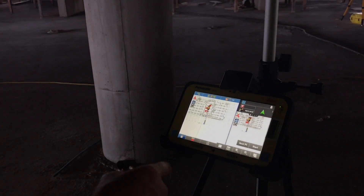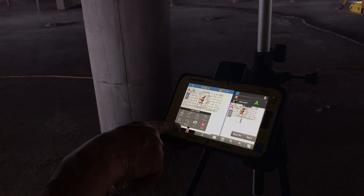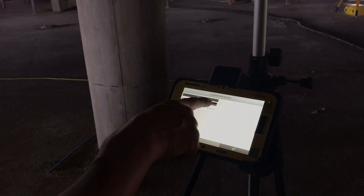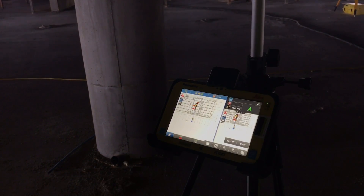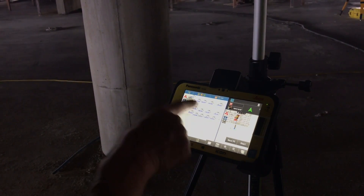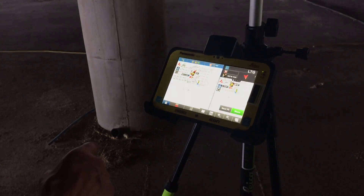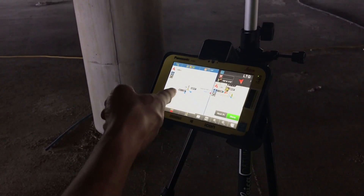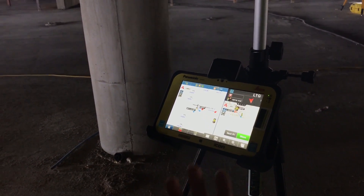Now after that, we're going to go right into our toolbox and select Auto Point Select. We're going to go to Nearest and turn that on — it's always defaulted to off, so we select on and hit the check mark. Now we just select any point on the screen and hit Start. After we do that, we zoom in to our location and it'll zoom in on the map to us, and we can see where we want to actually stake out.